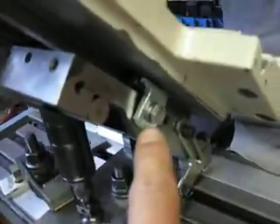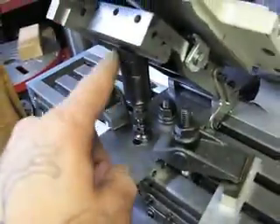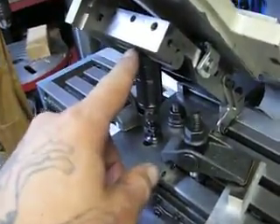I have another just store-bought dowel pin in here, and it's actually curved off on the edge, and it's also kind of cut in so it gets on top of that dowel pin and kind of holds it down. My other hold-down is just a screw that goes straight through into my table. My setup height is 4.5355, right around there.